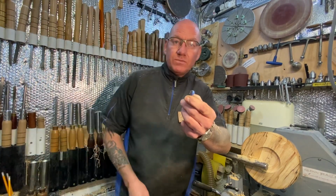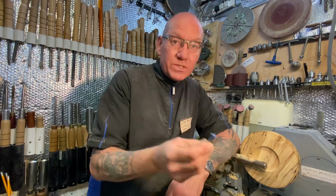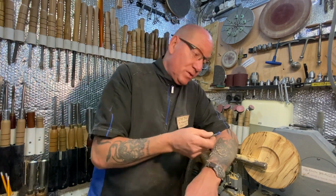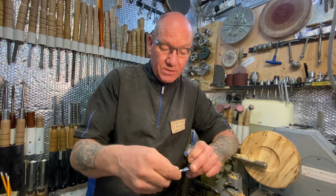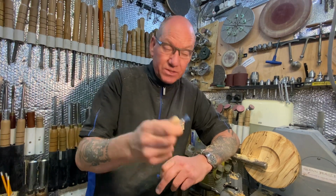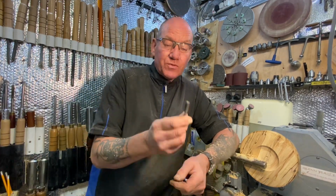But you can use your round nose bit in there. Use your dovetail bit. If you want to put your mortise in, use your dovetail bit. You can't do your tenon because it only cuts on one side. Router bits, they don't cut on both sides, but you do get two cutters, so you can turn it around. If you want to do your little bits, you can put your little straight bits in there.